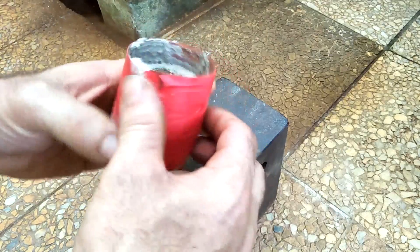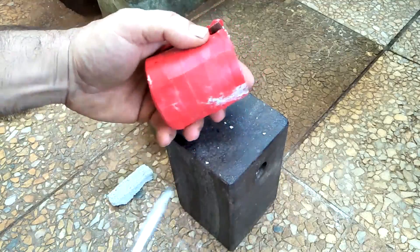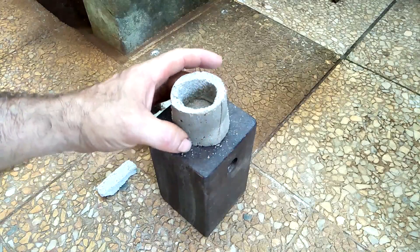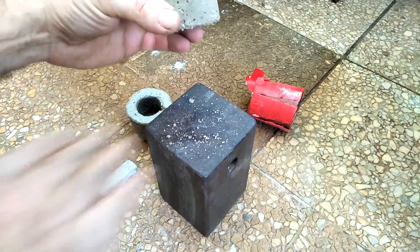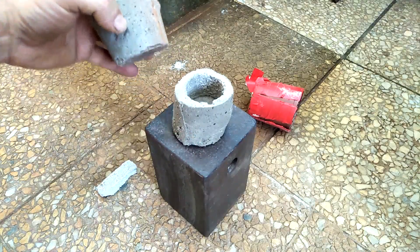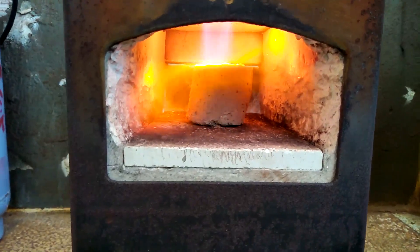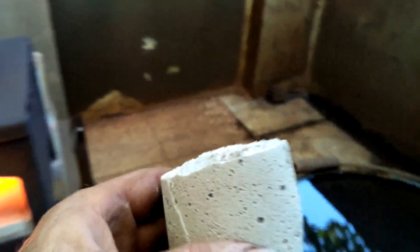The third crucible is also dry, and I really think it's going to work well. I'll cut this open — there's the uneven-looking crucible; not very even but I think it'll actually work pretty well. It's still a little moist and crumbly so I'll let it dry more, then fire it in my forge, possibly dunking it in water like the second one. I fired the third crucible, let it cool completely, then submerged it in water just like the second — and it just disintegrated in my hand. Complete failure.